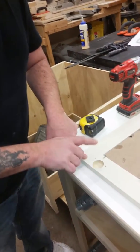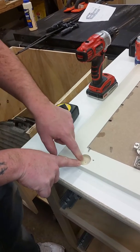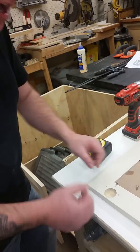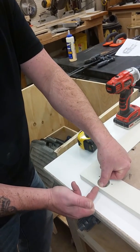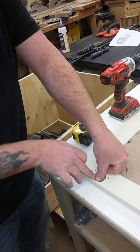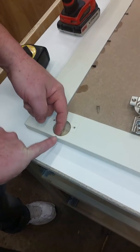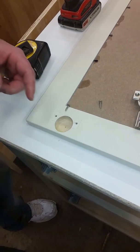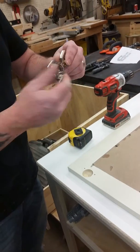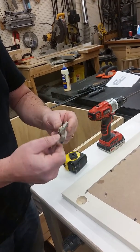The reason I need it that way is because that's how I drill for these. I don't find center at eleven-sixteenths off this edge and all that — I want that measurement because over at my drill press when I drill for these, I offset the bottom of that hole exactly to what you say your hinges are. There's a little room for error — we have three thirty-seconds of an inch to move around, which is plenty.